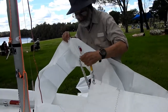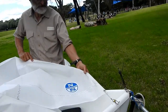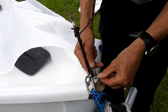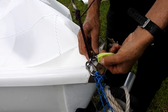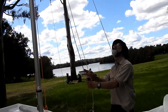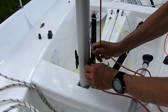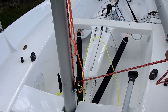Now, we find the tack of the jib, which is the lower point of the jib at the front of the boat, at the bow. Once again, there's a shackle here. The pin on these ones does come out when you're packing up the boat. The idea is to put the shackle pin straight back into the shackle it comes out of before you get a chance to lose it - they are expensive. I'm just going to pull the jib up. I'm just going to put this halyard through a hole in the cleat there, then through the pulley here.